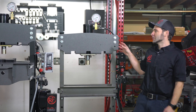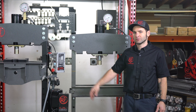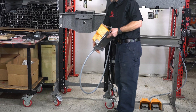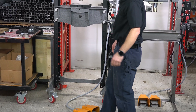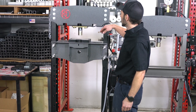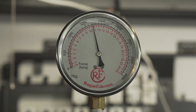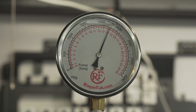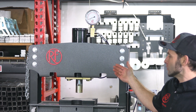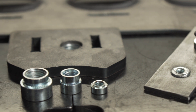Now that we've shown you some of the mechanical variations and how you can get them in your shop, I want to show you some of the more advanced controls. Every VersaPress is controlled with foot pedals — one for up and one for down, or extend and retract. The primary force and pressure display is this glycerin-filled gauge, which reads force in tons and gauge pressure in PSI, so you always know your line pressure and linear force, which is really useful for tasks requiring coordination of force, like PEMSERTs.